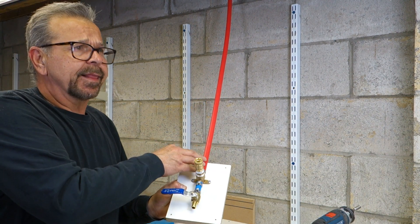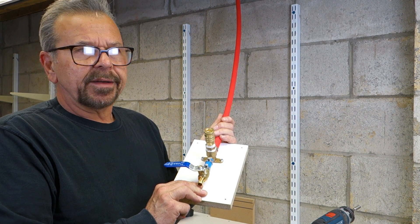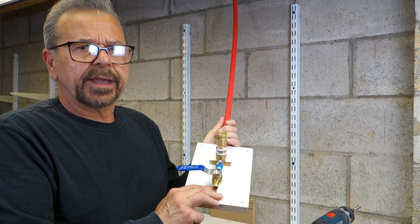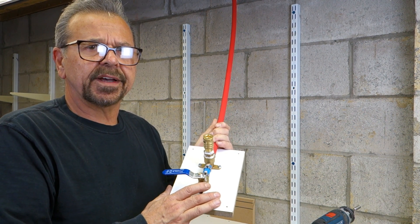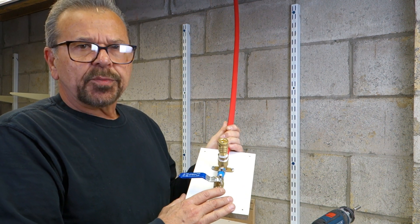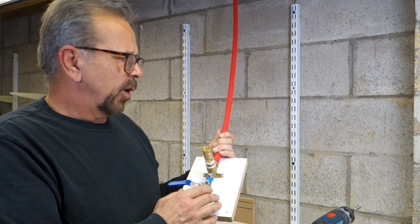This crimp here is rated higher than the line's capacity. I think the line at 72 degrees Fahrenheit is rated at 160 psi. We only run 135, and burst pressure is well beyond that. It's not really an issue until you start getting into higher pressures like 160, 180, and 200 psi. Half-inch line is more than adequate for what we need, both as far as pressure and as far as flow.